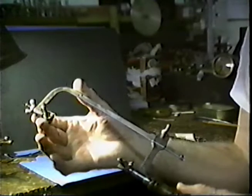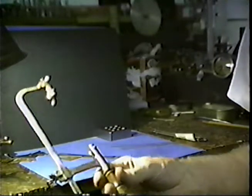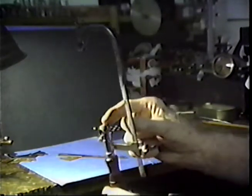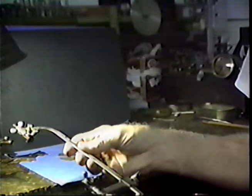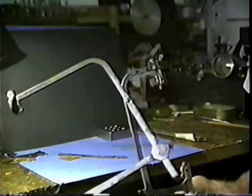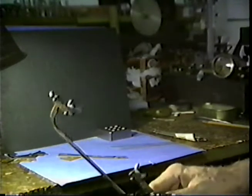This shallow frame has much less flex to it and is considerably better. Most of the cuts we make will not require a depth greater than this frame depth. Therefore, it is easier to handle, kinder to blades, and lighter to use. So this is the favorite size, unless a frame is needed that definitely requires the depth of the greater frame. It is not that the larger saw is not good — it is a misapplication of the particular saw.